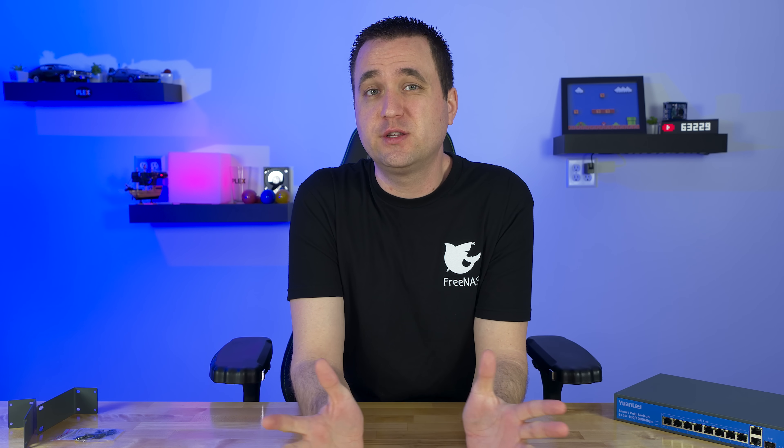And because it's an unmanaged or dummy switch, it's super easy to use. You don't have to log in or configure anything — just plug it into your network and you're good to go. From a PoE sense, it's got eight usable ports to power cameras, they all work at the speeds they're supposed to, and you have two uplink connections for good network reliability if you ever run into an issue with one of your cables.